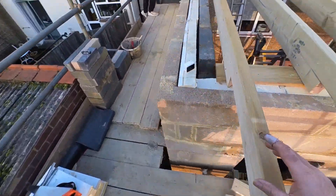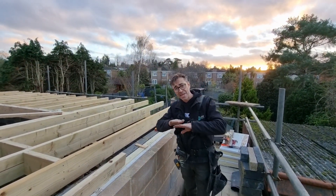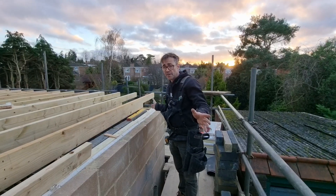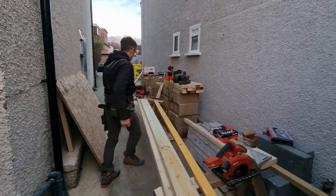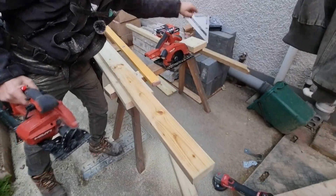That's the eaves cut. So once you've got all your joists on for a flat roof, you need to create a fall — you need to get the water away. I'm going to show you the easiest way of doing this, especially when making long furring pieces. I'll measure my overall length — four metres long. All we need to do is measure half the length, so in our case four metres means we measure two metres.